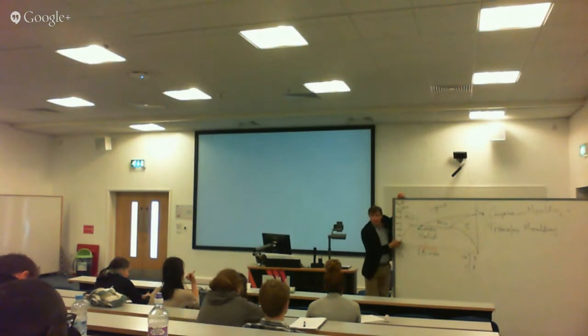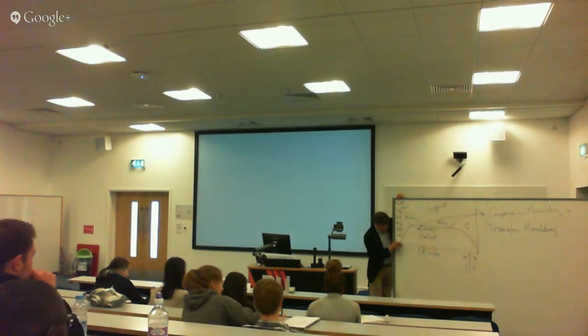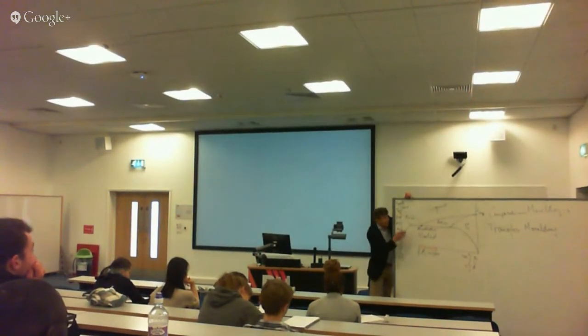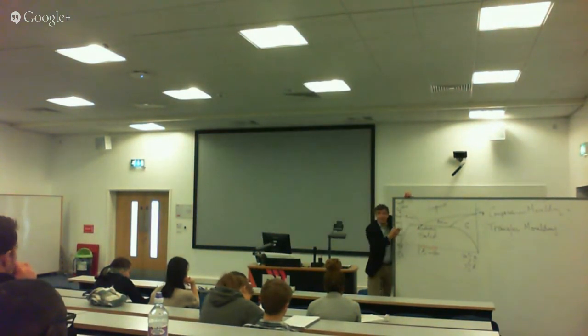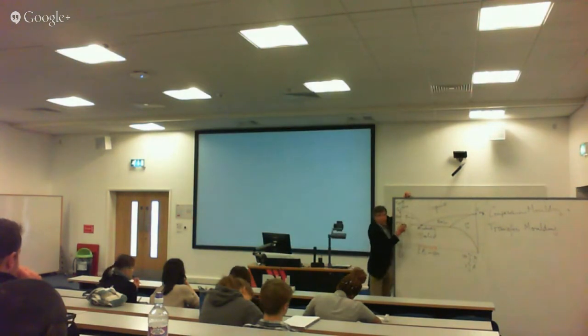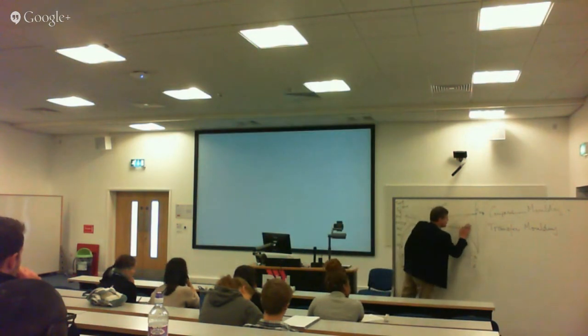I said here you have a solid, but it's not pure A. It is a solid with some A and a little bit of B. Here it's a solid that is very rich in A. Normally this is called a phase or a region. These things are called a phase, as in P-H-A-S-E. Normally these phases are given Greek characters, for example, alpha, and this one, beta.